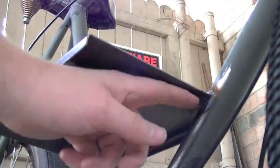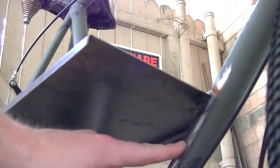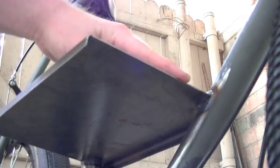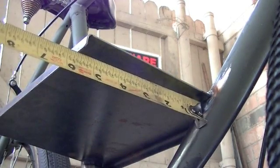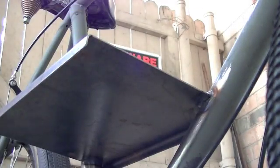I'm going to make it a flanged fitting. It's going to be just straight butt welded to the tube here, but up here it's going to be flanged. And then on the top I'm going to do rosette welds, and the same with this back piece. I'm only going to make it 4 inches just so it's easier to work with in the press brake.